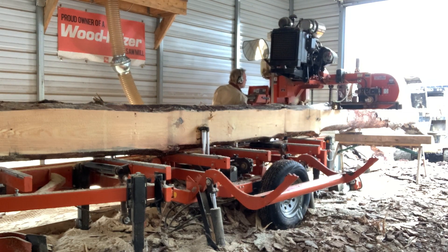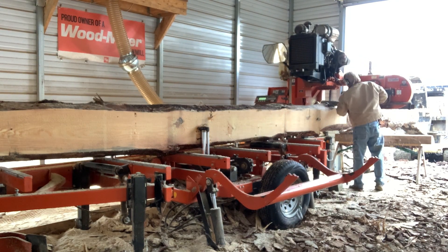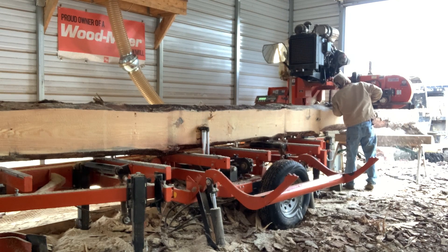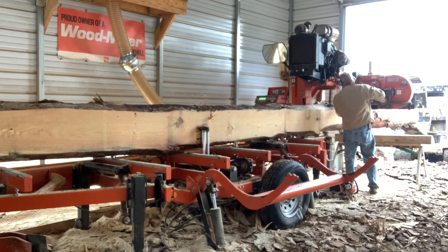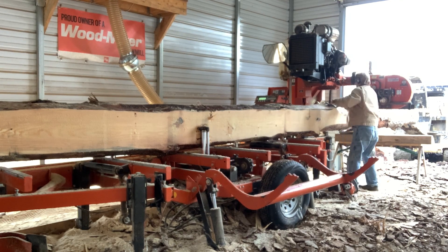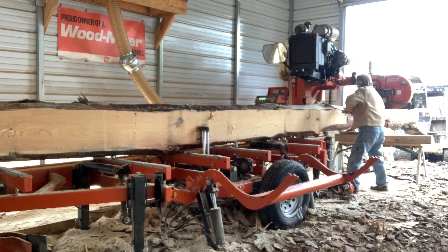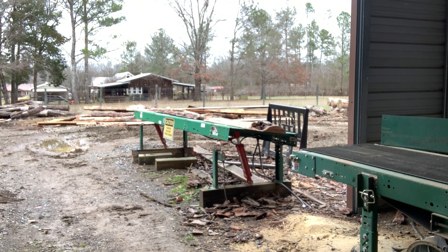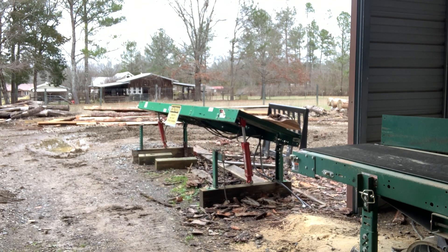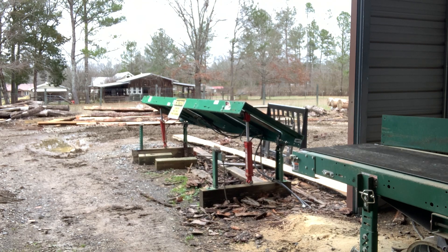So here I'm making this cut. You can see I've got it braced up on that far end with the sawhorse and a couple of spacers. It's just kind of an added extra precaution there to make sure that log doesn't move as I'm cutting. I'm prying this flitch back to get it out of the way — just enough to get that drawback arm down inside there is all I need, so it doesn't take much. I think I moved about five or six inches. That worked out pretty good.